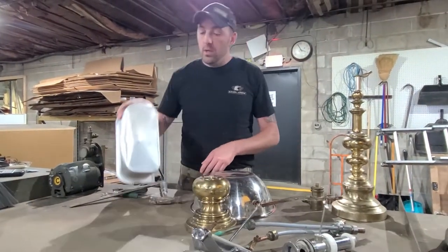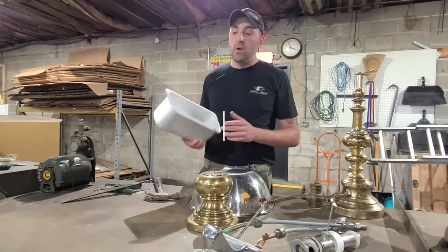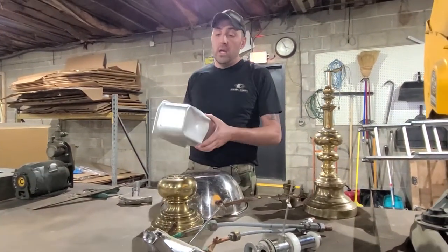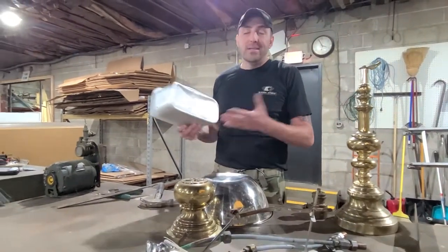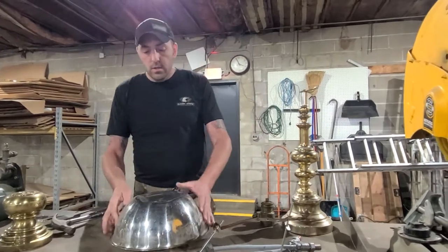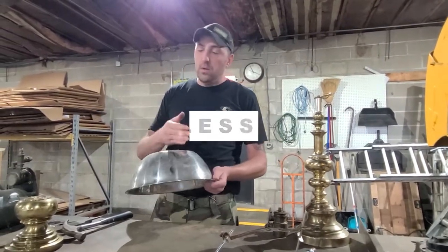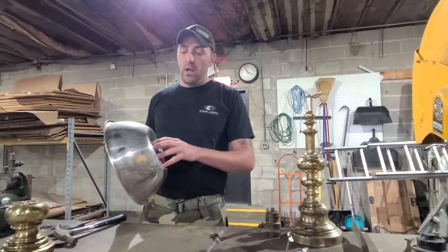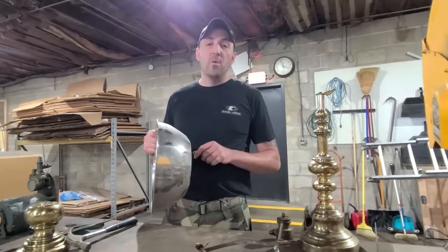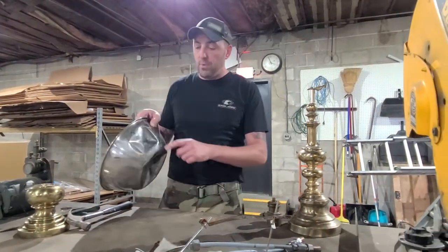So let's take a look. Hammer — it dents it, the whole thing's dented, nice soft metal. We know that's aluminum. We sort aluminum by nine different grades here. This would go as aluminum sheet — if you can bend it and move it with your hands, it's aluminum sheet; if you can't, it's aluminum extruded. If it would crack, cast aluminum. Next piece — hit it, a little gouge, not a full dent. We know this is stainless steel. When I hit it with the file it didn't go nearly as deep — it just gouged it.